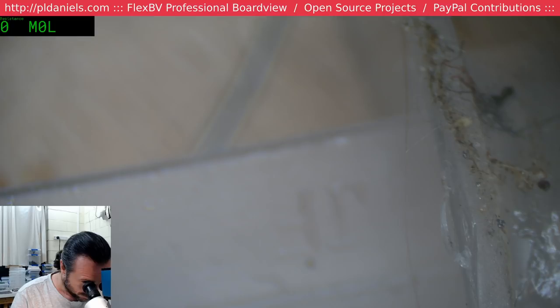Wow, that is a good amount of flux. Liquid damage, BIOS removed. No kidding. Now it's getting to the point where it's flux damaged. Whoa, what happened here? Did they stuff up the Thunderbolt? Very rarely do you dig under this. Holy shoot. Okay, so what they've done here is they've left the flux on for too long, and the flux has started to actually eat some copper. Backlight's completely... Wow. Yep, I think this is going to be a fun little project.